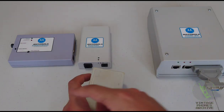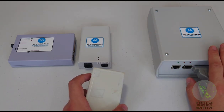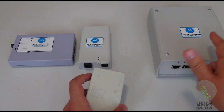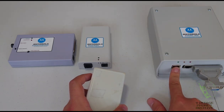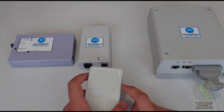The transfer wasn't direct from the computer to the phone. This was good if you had multiple phones to do of the same kind. So if you wanted to flash multiple phones of the same model, you would put the flash onto the RAM. It would take longer, but then once it was on the RAM, you could flash the phones much faster through the RJ45 ports, and the firmware would stay on the RAM.